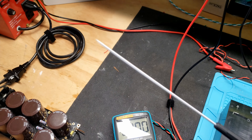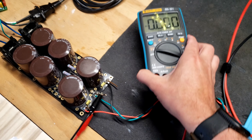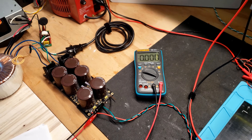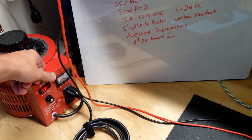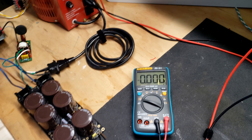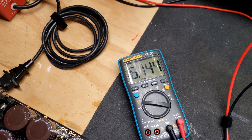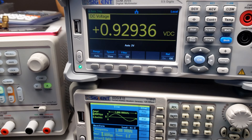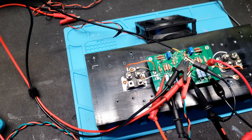Let's set these meters to millivolts for a bit more accuracy. Make sure the variac is turned down to zero and we'll watch the voltage climb — we'll also watch the scope. This channel is my second one powering up; the first one was pretty basic and uneventful. Variac on. We already have hardly any voltage on the output, already at 10 volts, and I don't see any wisps of smoke anywhere. We have about 15 millivolts across the resistor because we're not up to rail voltage yet.